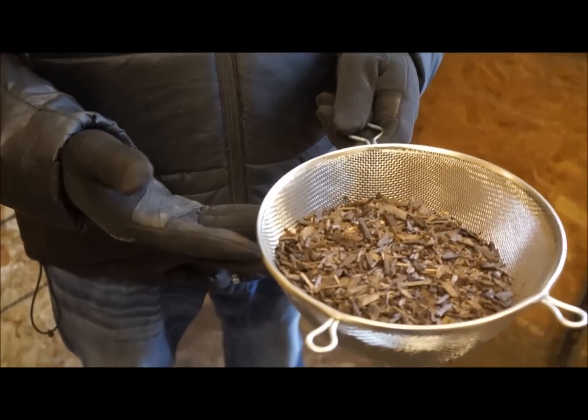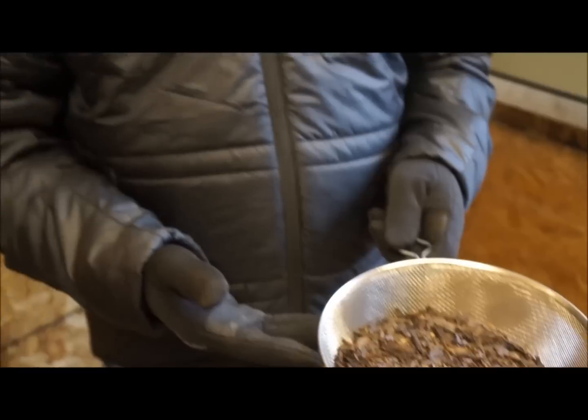What a Torreactor does is it roasts the wood chips. It roasts them in a zero-oxygen environment for about 15 minutes and gets them to a temperature of about 550 degrees Fahrenheit. When they come out of the other end, they're a nice dark brown colour like this sample I have here. In the process of roasting these chips, we've cooked off the hemicellulose in the wood and boiled off any volatiles. The resulting product is a more energy-dense product than regular wood chips. They can be further processed into either pellets or briquettes and used as a renewable fuel that has much of the same properties as coal.